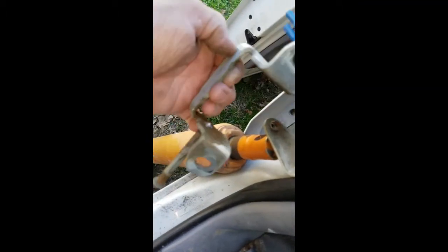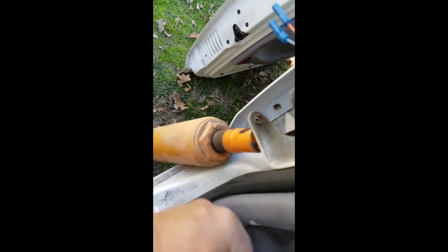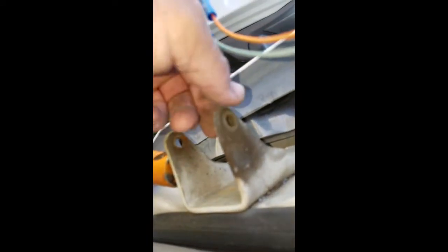That's what the pin looks like, that's what the bracket looks like. You can see the bushings — the top bushing is slotted pretty good, and that bottom bushing is blown big time. I'm probably going to have to get the welding machine and weld a little washer on there to get that hole centered and in the right spot.